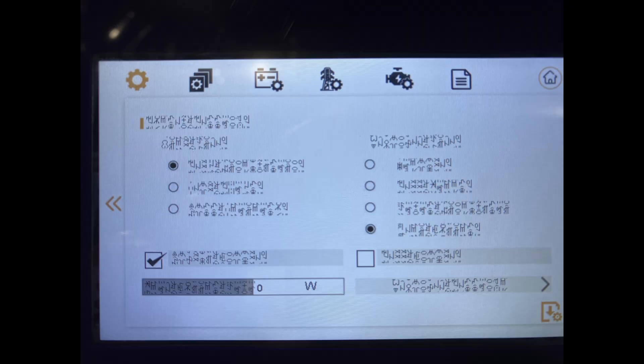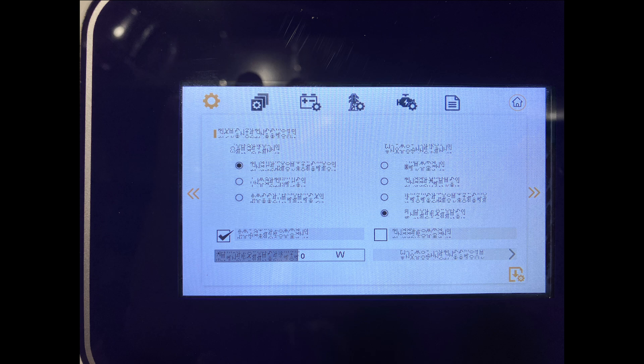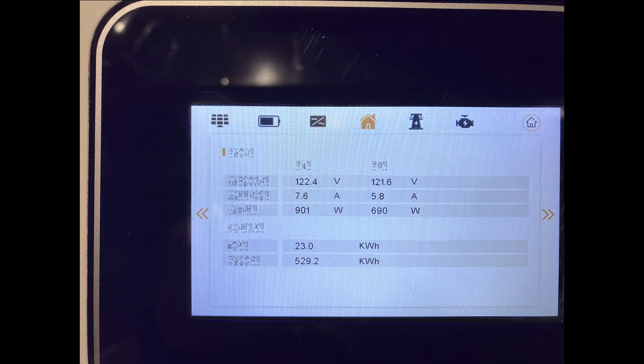We're going to start with the display firmware. I'm going to show you why you need a higher quality storage device, because my first few attempts I did not have one. After I got the firmware loaded up, my display looked corrupted — the entire process looked like it went through fine, but I could not understand any of the text labels on any pages. I tried factory resetting and a bunch of different things, and it didn't work. Once I got a higher quality storage device, it actually wrote properly. So if you see garbled text after the firmware process, you need a better storage device.